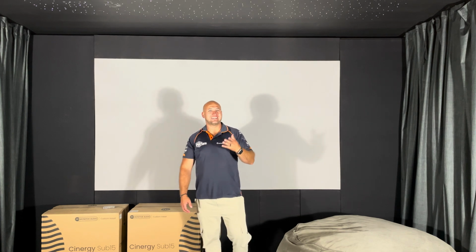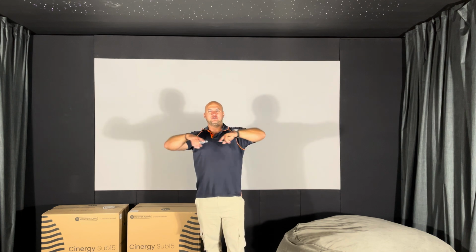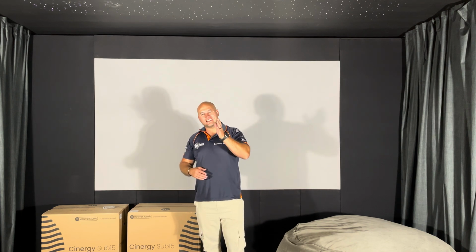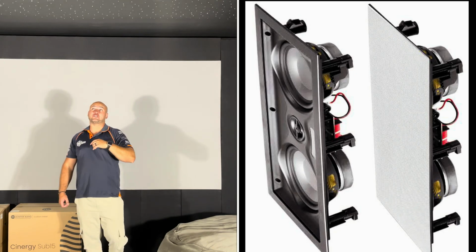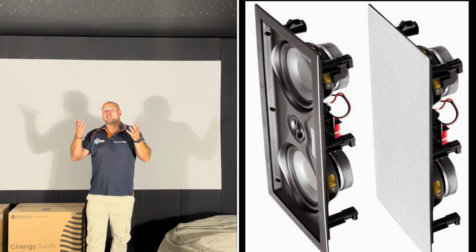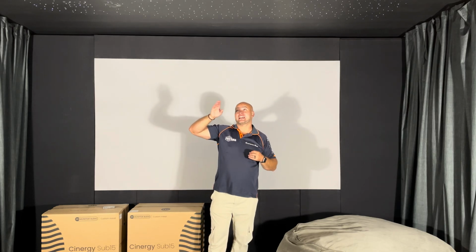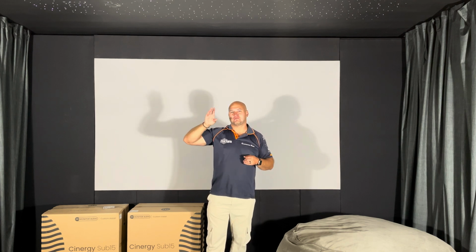So for the States guys, which have drywall and stuff like that, it's easy for you to cut a hole, install a speaker, but you might be having unwanted rattles like we have with our ceilings. So then I do not run hectic hertz through the ceiling speakers. I will cap those at 120 hertz on the crossovers. I don't want them doing too much bass.